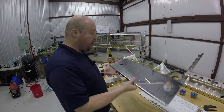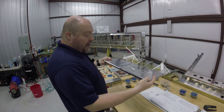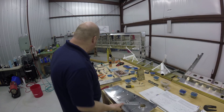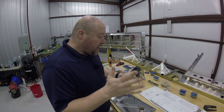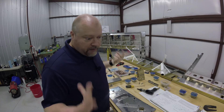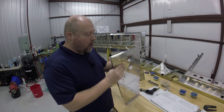I am done Clicoing together the inboard seat rib. I've got the other side Clicoed together but not yet riveted. This one's all riveted up and ready to go. I'm not unhappy with it — I think everything came out great, with the exception of right here on this NACA vent. My gun setting was a little too high. I had adjusted the pressure when I was working on some of those thicker pieces with the bigger, heavier rivets, and unfortunately on this really thin aluminum vent stock it kind of bent it a little bit — it was hitting too hard.